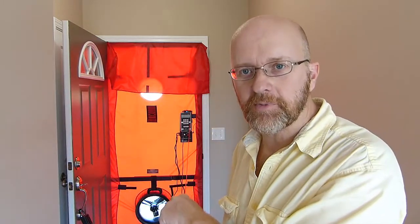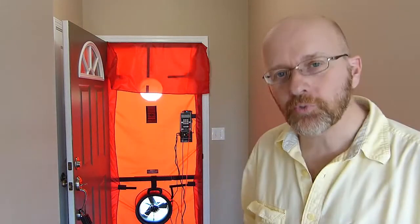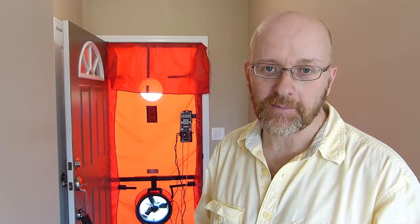I have the fan set up again with the gauge plugged into the blower door, my green tube running to the outside, the red tube down to the fan. The gauge is set for duct blaster model B under the device, and I have it set to open. We've already taken a baseline, and I'm going to use my Wi-Fi controller so I don't have to stand right next to the fan — and you can hear it's actually a pretty quiet fan. Just like the blower door, you can install the rings on this to restrict the aperture of the fan for a really airtight house. I remember testing that passive house with this fan and ring three — an opening only about that big — for 134 CFM at 50. But most houses, like this 2,400 square foot house, will test between 800 and 900 CFMs, so I just run the fan wide open and we get very accurate results.